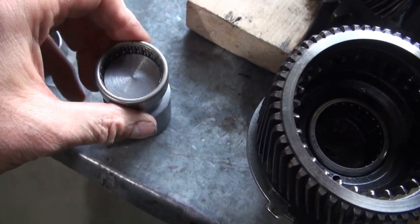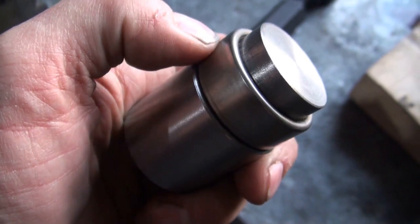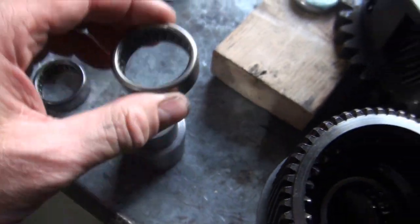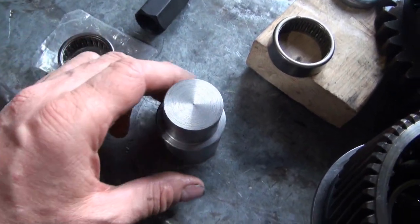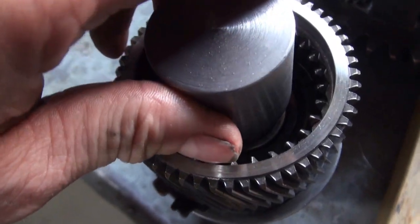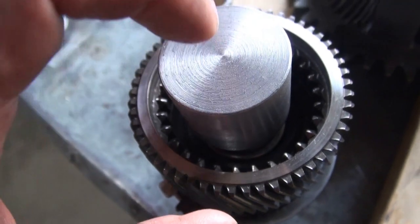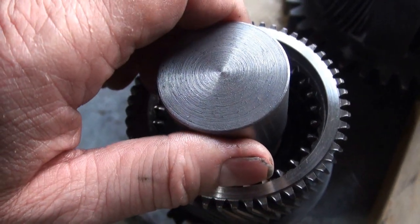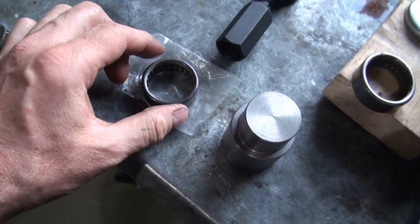Here's a used bearing — it slides on there nice. The driver is made so that the shoulder is a little bigger than the bearing itself, so that the driver has something to bottom out against when it presses down inside there. I noticed that the new bearing, I can get it on here, but it fits more snug. I also tried to get this bearing driver down inside there, inside the bearing that's still in there. I could get it in if I gave it a couple of good whacks with a mallet, but that's not what I'm after. It needs to be able to exit very nicely and freely so that there is no bearing damage done when the new bearing is driven in.